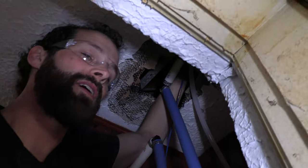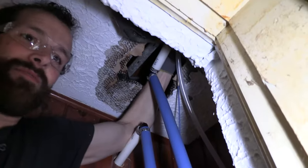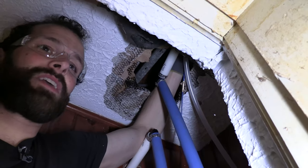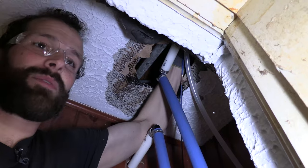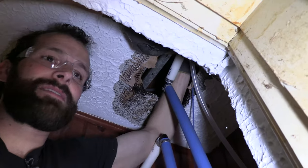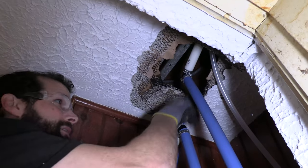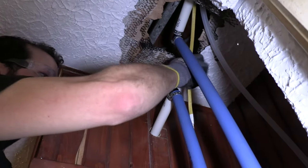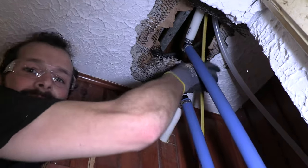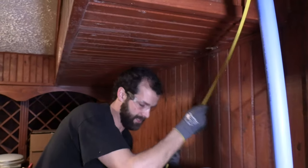The plumbing barely fits through here. A question asked periodically: what separation do plumbing and electrical need? In our jurisdiction, they can share holes and stud bays and framing cavities. Check with your inspector. But the one place they can't share is at the electrical panel or any major electrical equipment — plumbing is not allowed there because there is open electrical. That constitutes a code violation.